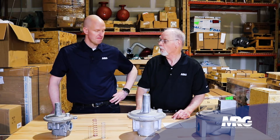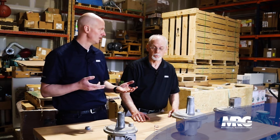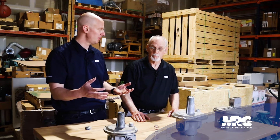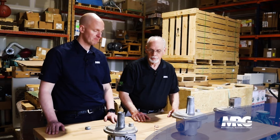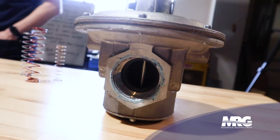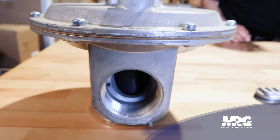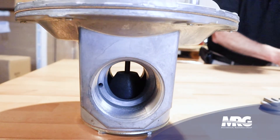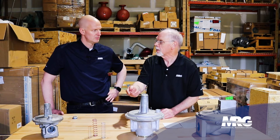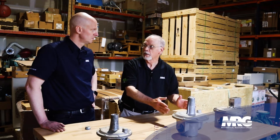Boilers want constant gas at a constant pressure with continuous flow to combust. This regulator stacks it up almost like an expansion valve, allowing a certain flow through and regulating that constant flow. Now, this one — you cannot see through it if you put your eye up to it, you see a wall. But this appliance regulator you can see through and see the plunger. The lock-up regulator has a chamber so inlet and outlet are separated, whereas the appliance regulator has much less separation.